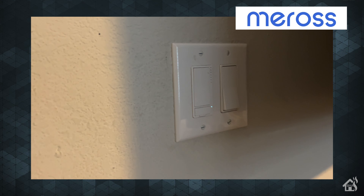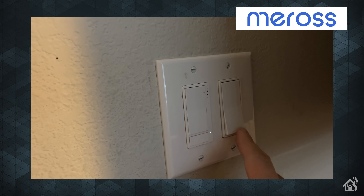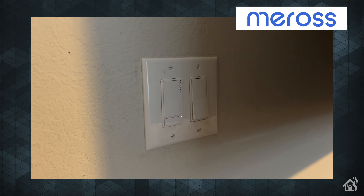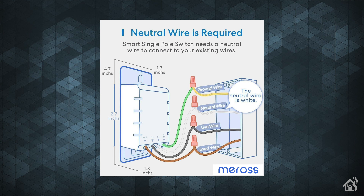The plan is to install the switch in my daughter's room, replacing an old Tuya switch that has really started giving me problems — it keeps dropping its Wi-Fi connection and always manages to toggle the switch when it comes back online, causing her lights to switch on and off. Now I'm using this switch in a somewhat special function: I use it to turn my daughter's LEDs on and off, and those LEDs are already controlled by a smart Wi-Fi controller. So I'm going to power the switch but not attach it to a load — I'll cap that wire off.